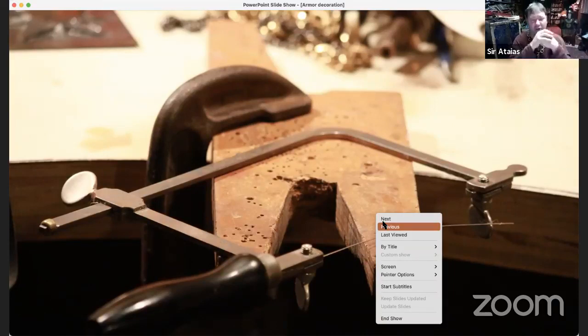To get the work that you want to get done. So for something simple like that, I'm fine with just clamping it down flat and doing the chase work there. I can even go for another pass on such a surface. Actually, I want to make these lines a little bit more defined, so I think I'll go over it again. The metal I've got right here is pretty stout, a really stout gauge of steel, and I feel confident I can do that without much problems.